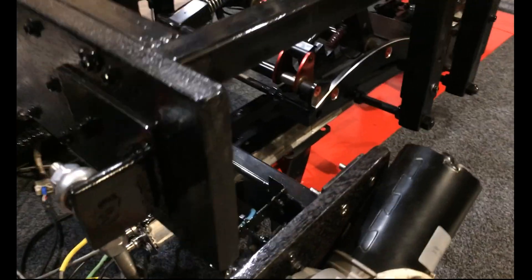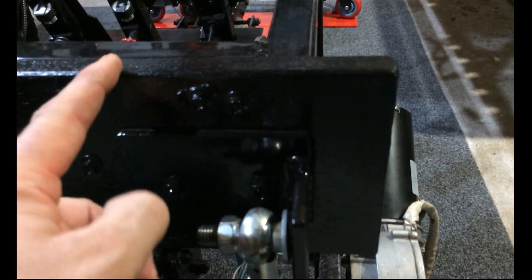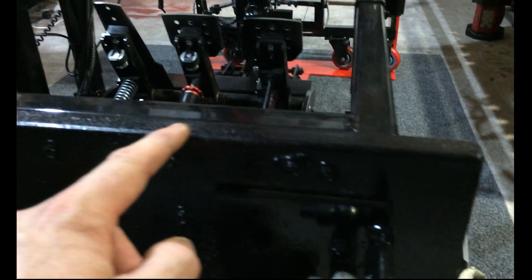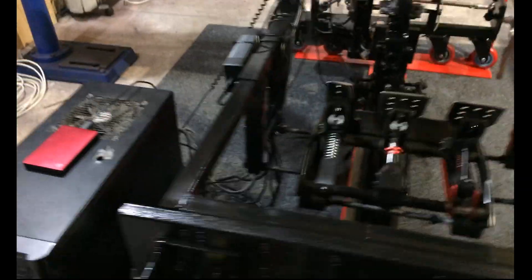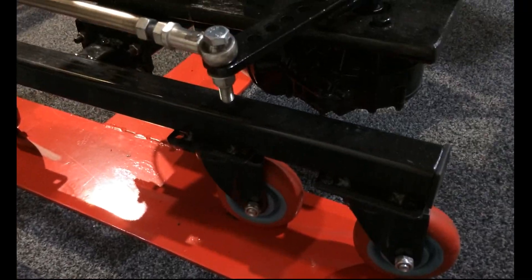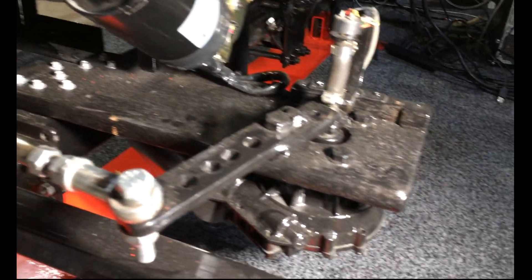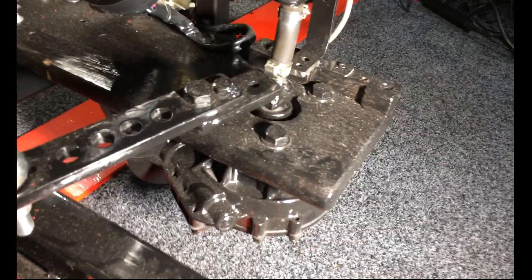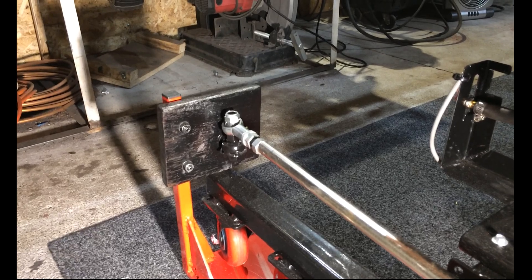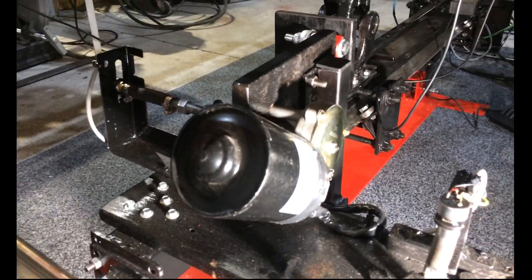Anything that comes from my motors — for example, where the lever is welded onto the motor shaft, you can see the lever there — it connects to the push rod that goes to the top frame via a metal bracket to push the top frame around for pitch and roll. But that metal bracket is then fixed into again the Merbau timber bracket to isolate that motor from the left-hand side motor and from the rest of the frame. The rear traction loss motor — there it is, hiding under another piece of 20mm by 140mm Merbau bracket attached to the mid-frame. Anything from that motor — its motor lever connects across to the push rod, which is again attached to some hardwood timber, so it's isolated completely.